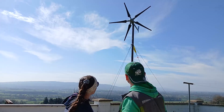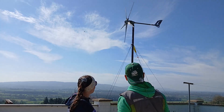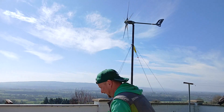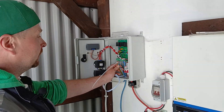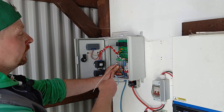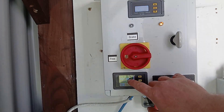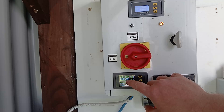Well, what do you think? There's a brown spot up there on the black — oh, that's from the wood. So now that it's up, how do you feel about it? She hates us. While Chloe comes to terms with the turbine all over again, I'm going to un-bridge the three wires which were keeping the brake on, put it back into the control unit, and hopefully when the three wires release, if everything's running okay, the turbine should start spinning up. The brake's not stuck on, which is good. We're starting to get some power readings now — just two amps, point six of an amp. System slowly coming to life.